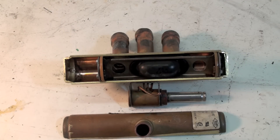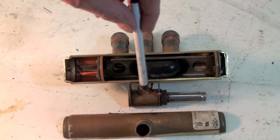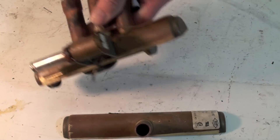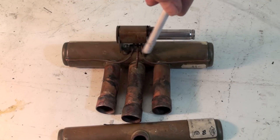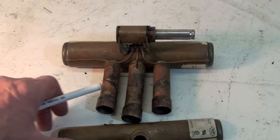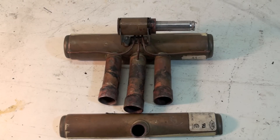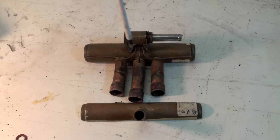Because this is a pilot-operated valve, it's important that the slide moves back and forth properly and that these pilot lines are clear. If any one of those lines gets blocked, the valve won't work. Problems with this valve often occur if there's garbage from a compressor replacement — that garbage gets in these lines and it just won't shift, or it may shift only partway.